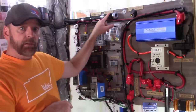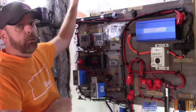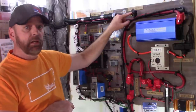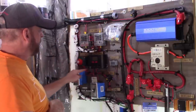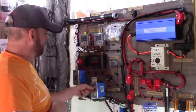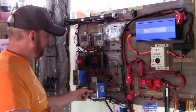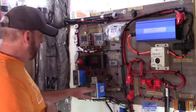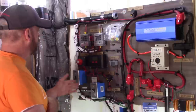This black pipe is the conduit going up to the roof. I haven't installed the panels yet — waiting for good weather. The panels and wire come down to this breaker, which is rated at 50 amps. It's a marine circuit breaker with a switch. From there it goes to the charge controller. Out of the charge controller the wire goes down to the charging circuit, which connects to the batteries. I've got a simple DC-rated on/off switch — nothing elaborate. Coming back out from the battery is a switch for the fuse block.